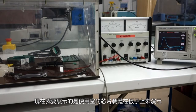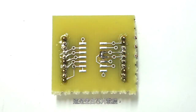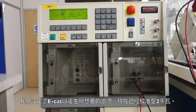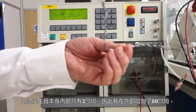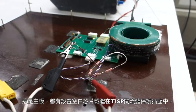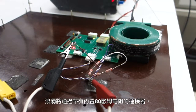Now what I'd like to do is demonstrate the raw performance of the TISP and TBU protection with no RS485 driver in place, using a blank chip carrier on the board. I've set up the scope to measure current into a dead short on the connector, since it's residual current into the protected circuit that we are interested in. We've set up the ECAT to generate the surge we want, which has now been calibrated for 2kV. I'm going to do the test according to IEC 61000-4-5, which for symmetrical lines like RS485 suggests that the surge is applied common mode with respect to ground, with 80 ohms in each wire. The surge generator itself only has 2 ohms internally, so I've added the 80 ohm resistance externally, in line with the connector wiring between the surge generator and mainboard connector. Here's the mainboard all set up, with the blank chip carrier in place in the TISP protection socket, and with the current coil monitoring the current. The surge will be applied through the connector with the inline 80 ohm resistors.